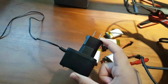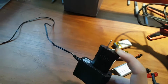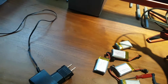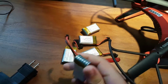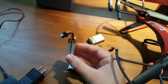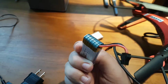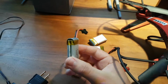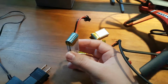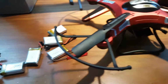Now I have a battery charger for my other RC vehicles that did not have the connector of these, but the local hobby store actually had one of those connectors, so I soldered it onto my Go charger, and I'm able to charge these with my smart charger and have them done in less than an hour, which is much better. You can also purchase the spider charging cables, but for lipos I wouldn't really recommend using cheap things or trying to get them to charge faster, because lipos are quite dangerous and it would not be safe.